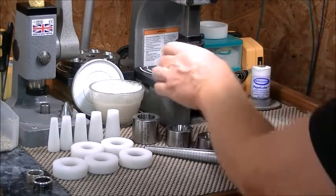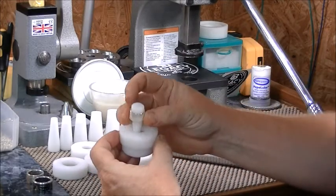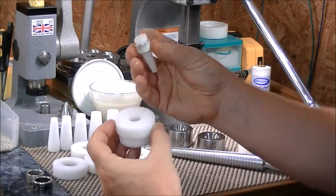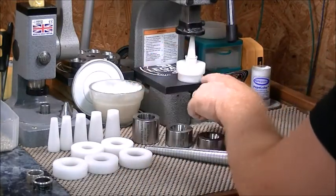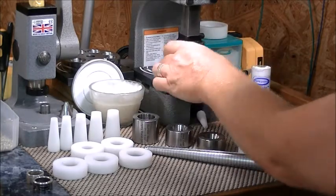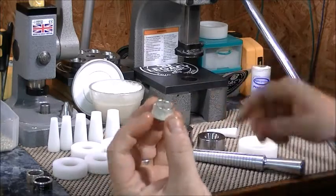Press down. What you've done is expanded the ring on the punch side — the cut side. To remove it, turn it over just like so. Make sure it's on your stand that supports your lid and press down. We've started opening this up and straightening the wall.